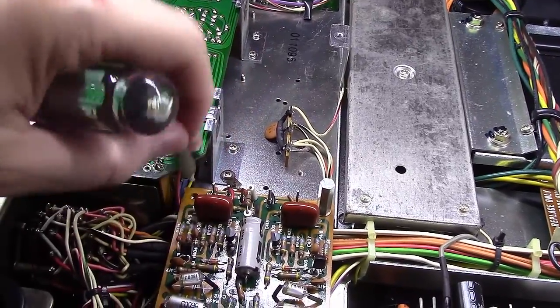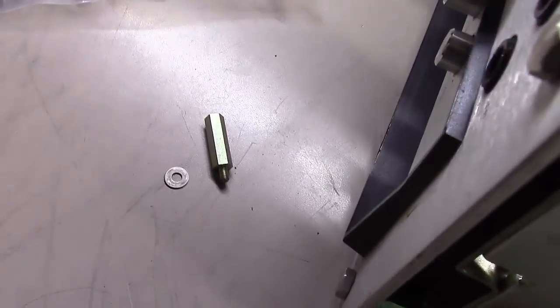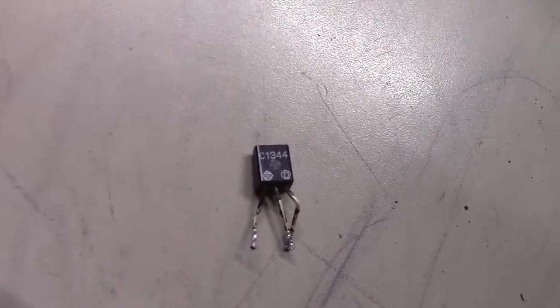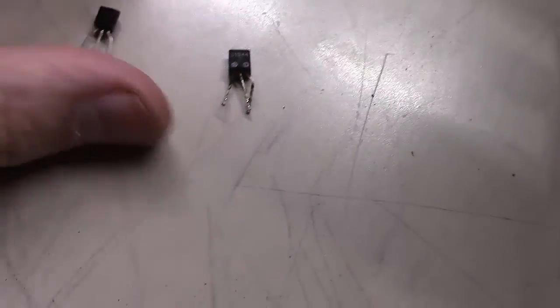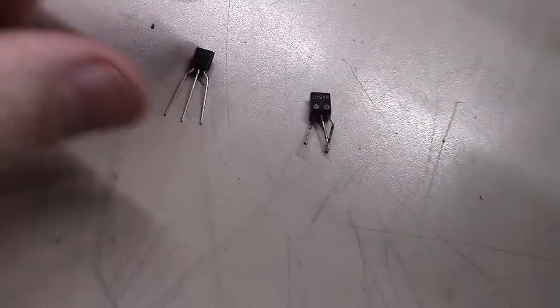You have to be careful — they've got a little washer on there that you'll have to end up picking up. But as you can see, you'll remove all four of those. I've got that one out and you may now be able to read on there that C1344, which is short for 2SC1344. And we're going to replace them here with these KSC1845s.